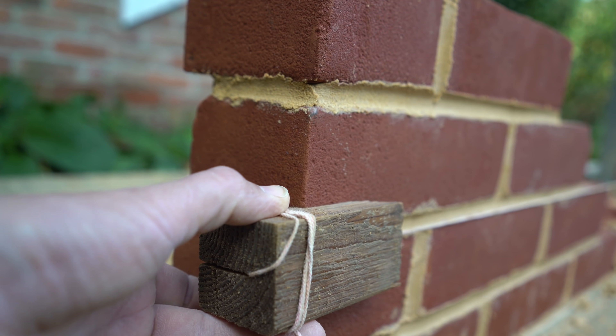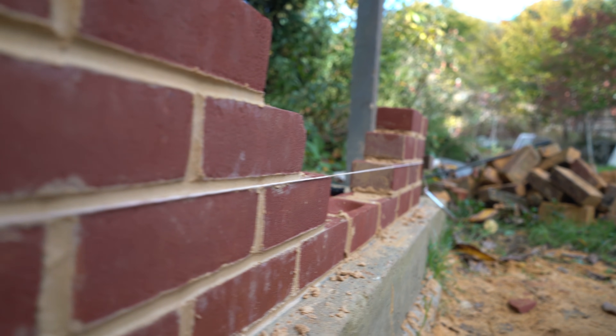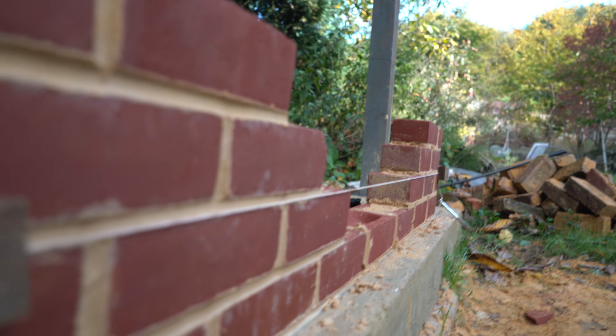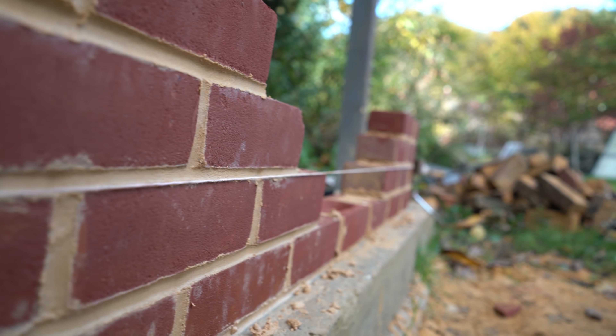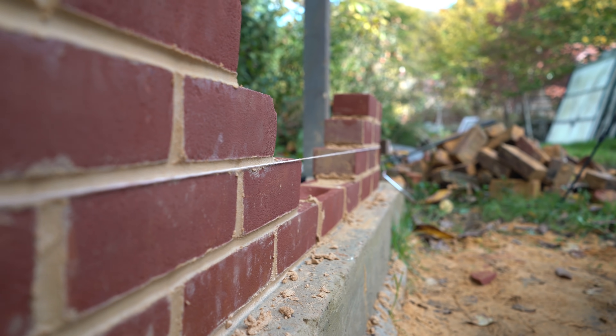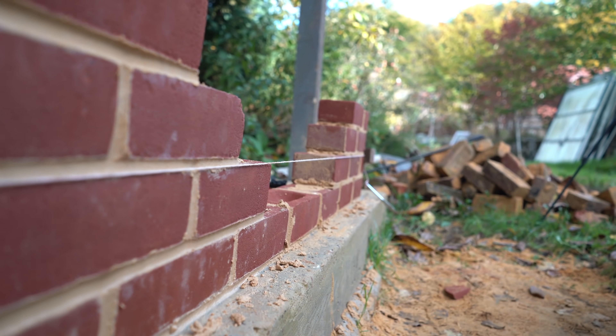If your corners are wet and the line is too tight, the brickwork at the other end will just get pulled off. It's quite simple — do it a couple of times and you should get used to it. The idea is to put them in there, tighten these up a little bit, and then we'll go through and show you how to lay to a line.